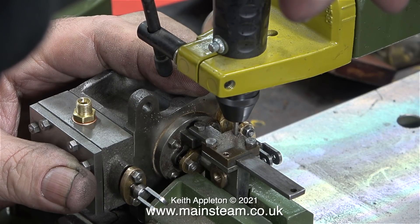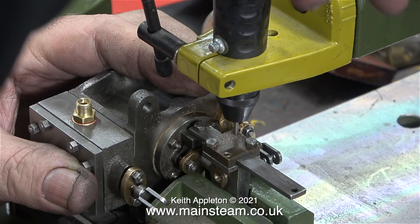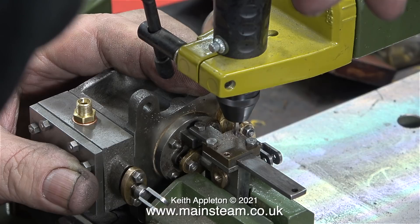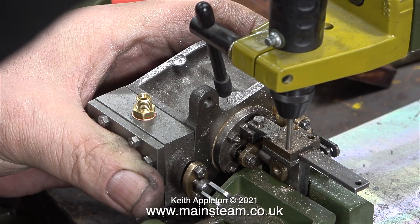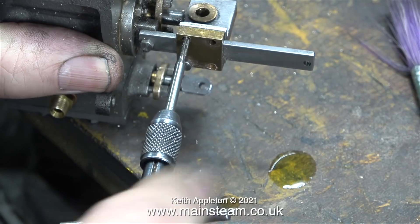It's a far more sensitive drilling machine than my main big drilling machine, and with this small Proxxon drill not having quite the power of the large one there's less chance of breaking the drill off in the work. It didn't appear to be drilling very well, but then I remembered that this was the drill bit I used in an attempt to drill out a broken stud in the low pressure cylinder and the end of it was very blunt. Once I changed to a new drill bit it cut through the steel parts perfectly.